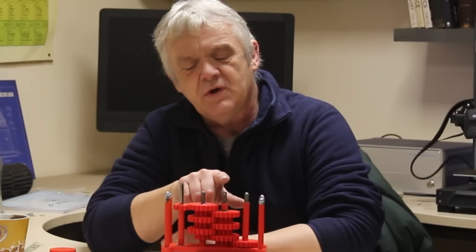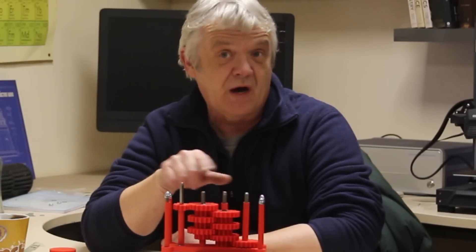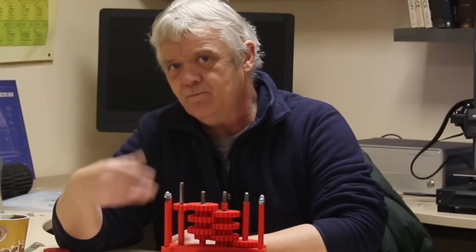The small gear's reference radius is 12.5mm and the large one's is 25mm, totalling 37.5mm — so they should be 37.5mm apart. In fact they are 37.75mm apart with that extra quarter millimeter of slop added in.